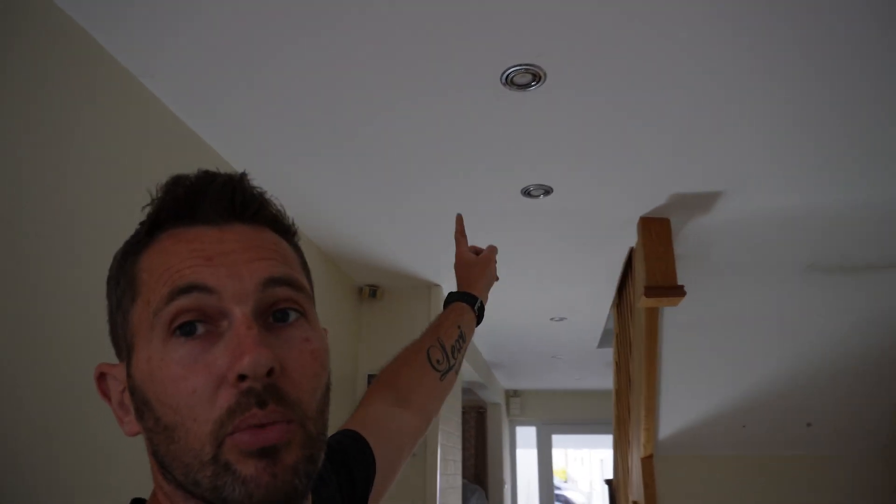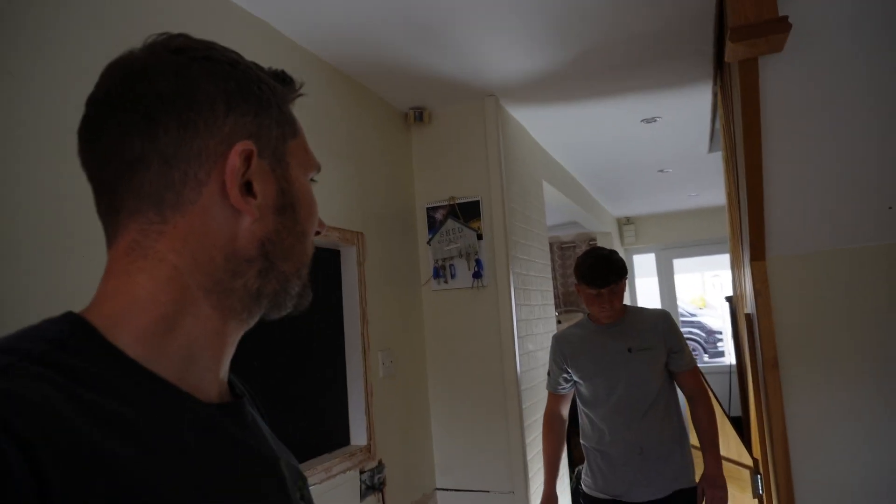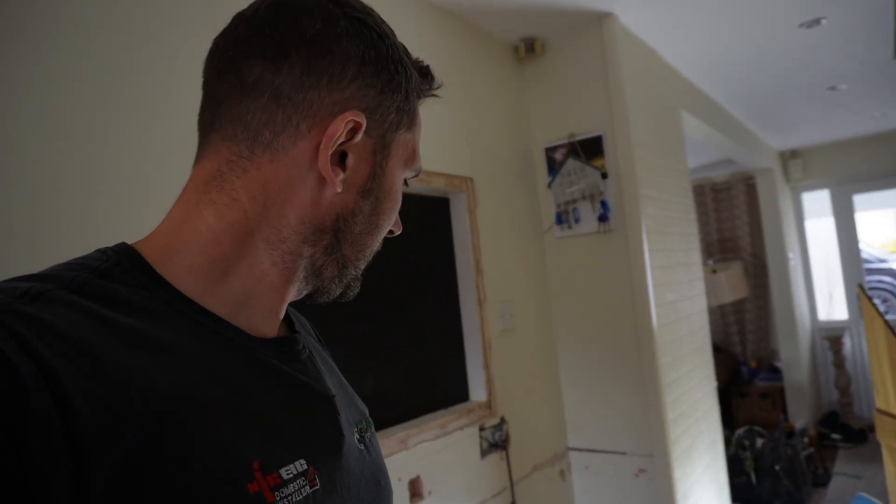There are a few little cracks - there's one there and another little hairline one near that one. There's not much movement. I think personally it'll get away with just raking out, filling and painting over. But somewhere along the line someone's taken all the woodchip off the ceiling and skimmed it, which is brilliant - but then they stopped here. So the rest of the hallway is all like that. It's all a bit of a nightmare. We're not really sure what we're doing at the minute, so we're just holding fire. If the ceiling is coming down, we need to crack on with it. Bear with me and we'll have a little update shortly.